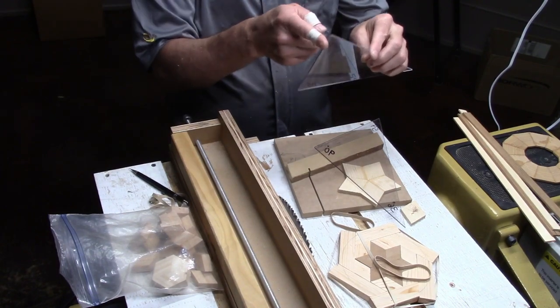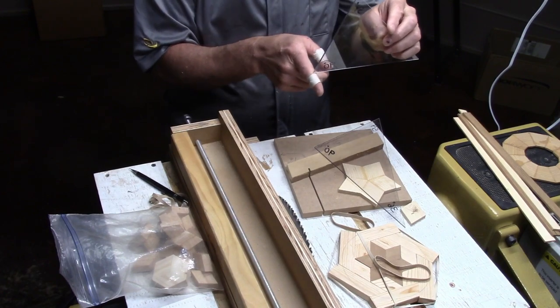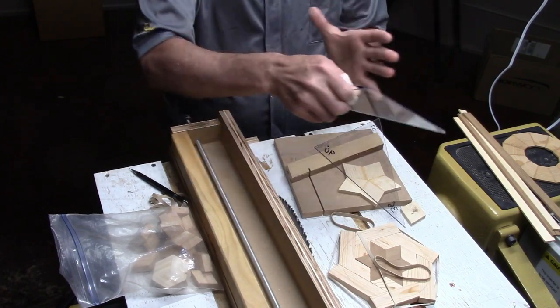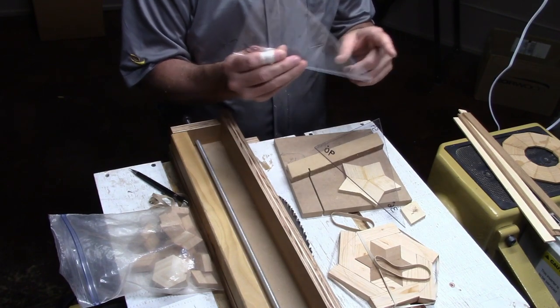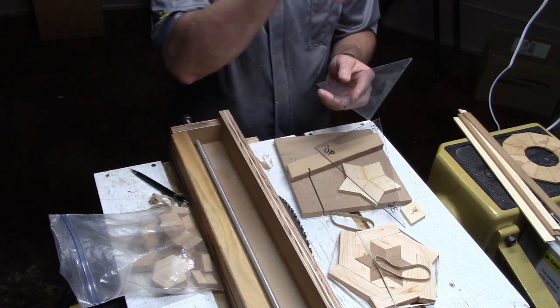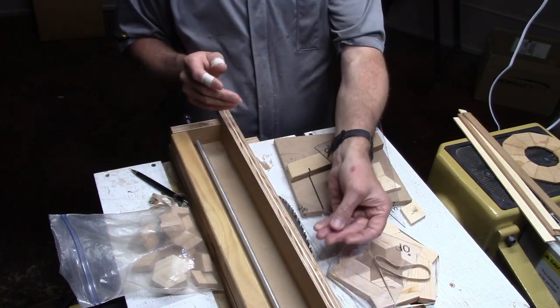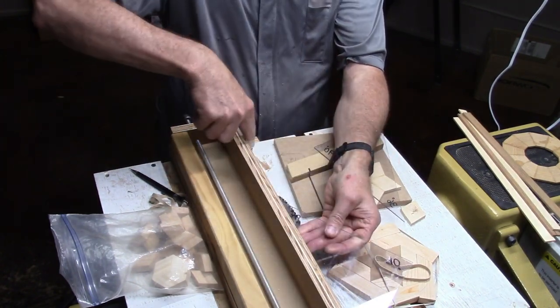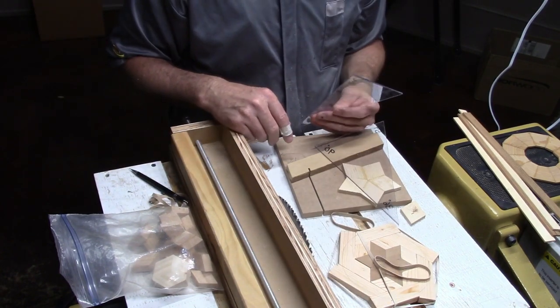First I cut this 90, I used a technique to cut this 90 degrees very accurately. Then I set up my table saw to cut an accurate 36 and cut all of these, all the ones that are in the room right now, I cut these all at once. And then I put 5 of them against my fence to make sure they came out just right. And that's how I did that.